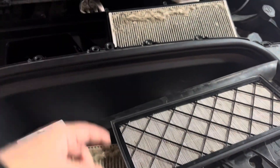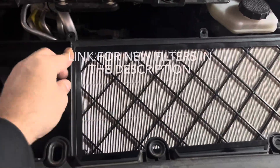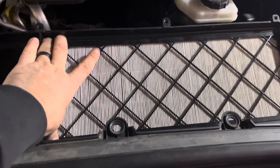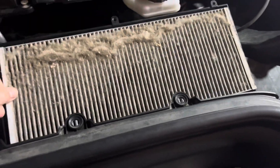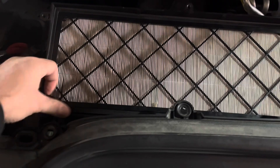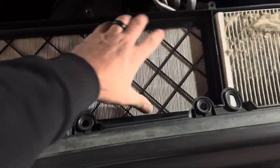Here are the filters I just removed to show the difference. They're really easy — these ones just pop out. The next level down, just grab onto the plastic cage and pry it up and out. To install the new ones, just reverse order. Place them here — I find it easier to start the rubber gasket evenly all the way around the top and then just push down in small increments all the way around, making sure that the rubber gasket doesn't roll up on you. For aftermarket ones, they sometimes don't have an arrow to show which side is up, but it's going to be the white band — the white band goes on top, no white band on the bottom. Put them in place, and same thing with the next ones: rubber gasket even at the top all the way around, then push down in slow increments as you go, making sure the rubber gasket doesn't roll over.